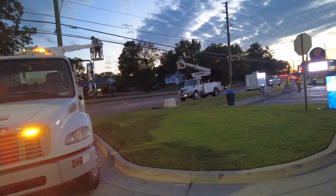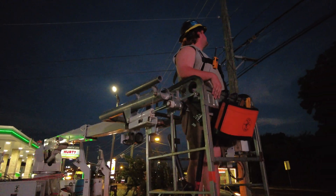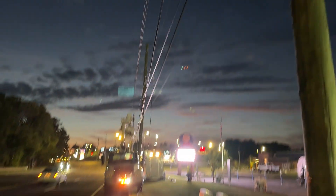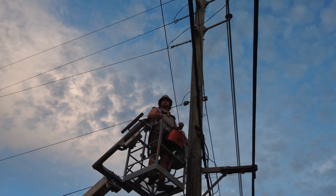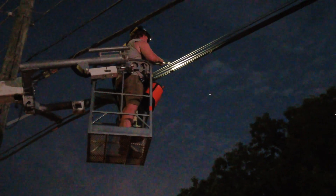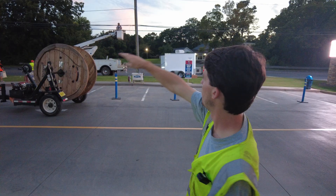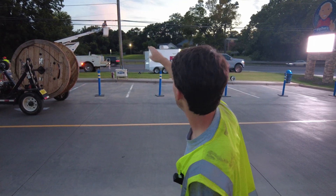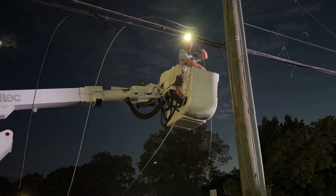Right now we've got two bucket trucks set up. We're essentially getting the slack for the cutover. The guy in this bucket truck is going to cut everything — the strand and the fiber. Right above his head is the new stuff. All we've done there is delashed our old fiber. It's all going to be cut, and all of this old cable all the way to the hospital is coming down. When he cuts the strand and the fiber, it'll drop down. You can see how the new stuff is already tailed out going into the splicing trailer. We'll basically tail that down — from this point back will be old stuff, and from this point forward will be new stuff. This is where the transition happens from old to new.